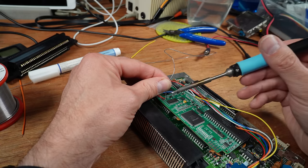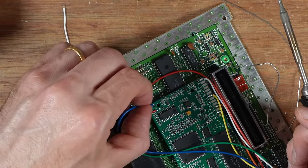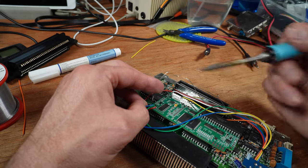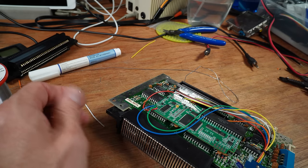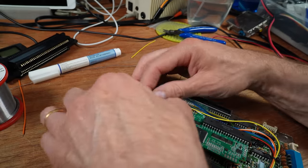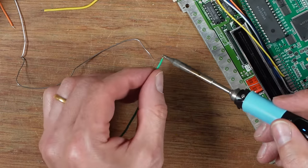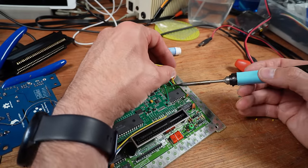The RGB signal wires usually connect to the top edge connector with all the other wires, but in this case the RGB board has those signals going through the expected 75 ohm resistors you find in this type of situation to bring the signal down to a voltage level the display can cope with reliably. Oh, that's my finger. Well, Merlin Shaw pointed out that the Genesis Mega Drive 2 cable has those 75 ohm resistors built into it. Even my rubbish one does. So to avoid doubling up and making the image too dark, the RGB wires need to be connected to these points on the Tim Worthington board right before they go through those resistors. You could probably take the resistors out of the SCART cable, but then if you used a different cable for some reason, it wouldn't work correctly.